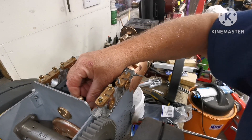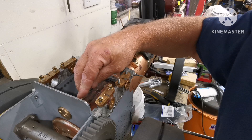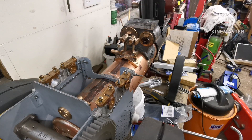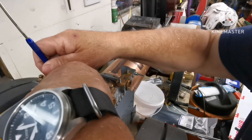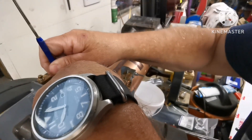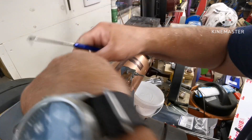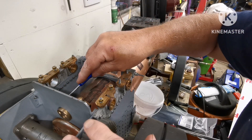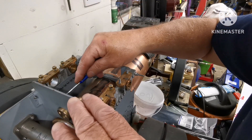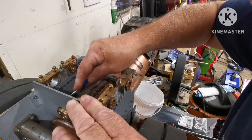Next thing, I'll just get that in place. What I'll do on there - I think I shall scribe through those holes. I'll put some blacking on there so it shows up. I'm just scraping into the manifold holes. Let's take a look at that - lovely, that's fine. Then I'm just going to scribe those two fire holes on this back spectacle plate where I couldn't get the drill in.